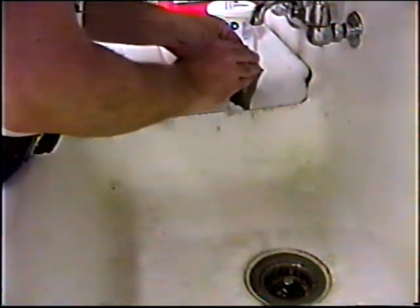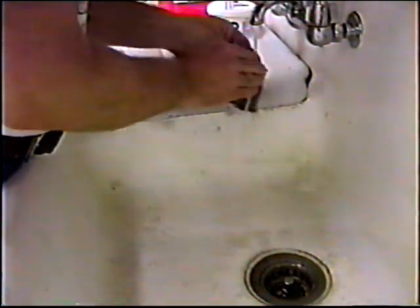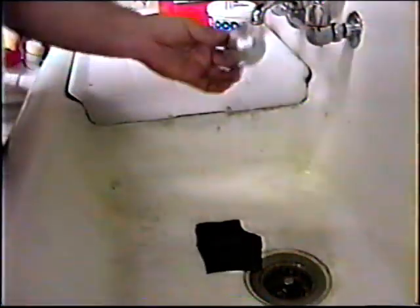If you choose to paint a spinner, you don't want to paint right over the aluminum. At the last, you want to put some M600 on it to degrease it. You certainly want to radius down every little razor edge that you can. That's an important part because that's where the paint starts peeling up from, all these little sharp edges.